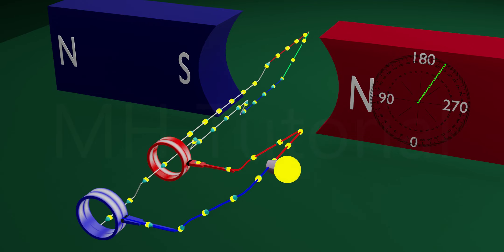After some time, when the red arm goes closer to the red magnet, the situation is different. At this instant current flows from blue arm to blue commutator, to red brush, to bulb, to blue brush, to red commutator, to red arm. Note that in both cases the output current is from red brush to blue brush — thus the output current does not change its direction. It is a DC current; hence it is a DC dynamo.